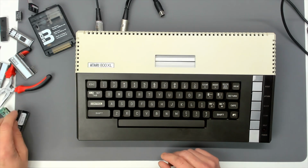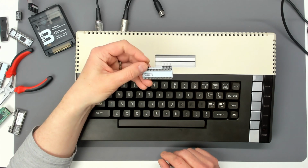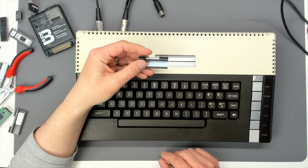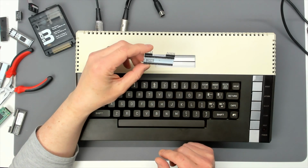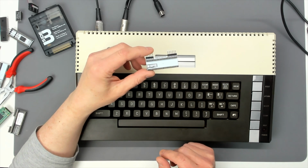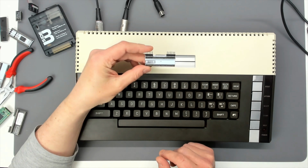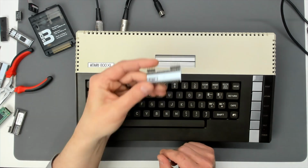We've also, as we've seen in the prior video, we couldn't get the older revision AKI board to work in this machine. The original firmware did work in this machine, but there are missing keys that make the thing more or less unusable, so I had two such boards and I upgraded them both with the fixed firmware that Candle provided. But unfortunately, it renders them entirely unoperational on an NTSC computer, and I was unable to roll back to the production firmware with the missing keys that came with the board, because we can't seem to locate it for some reason. I don't know why. So these older revision boards are entirely useless at the moment.